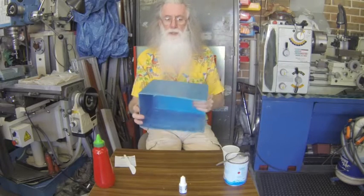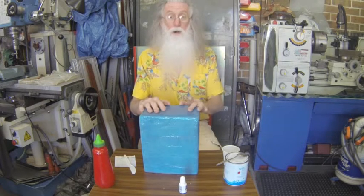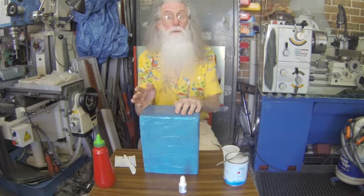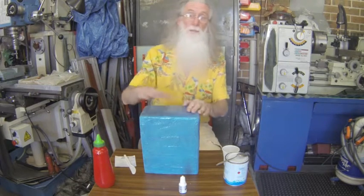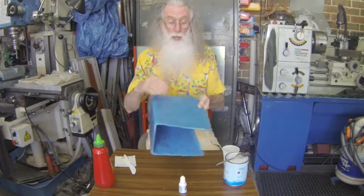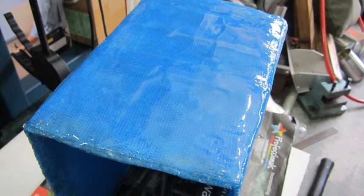Now because I wound this by hand, it's up and down like a honeymooner's 90. And the trouble is, if I want to get it to be a showroom finish, I would probably have to put it 3mm, 4mm thick, sand it back, fill up the low spots, sand it back, polish it. Now, as this was an experiment, a foray into No Mess Fibreglass and Flowcoat, it's worked. The top came out fantastic, the front came out pretty good.